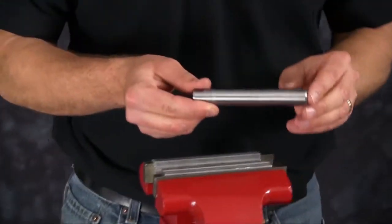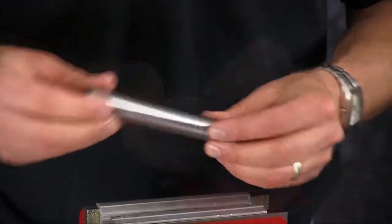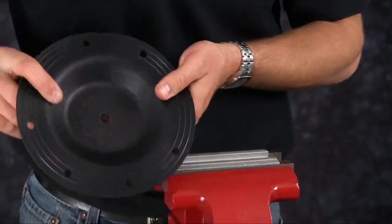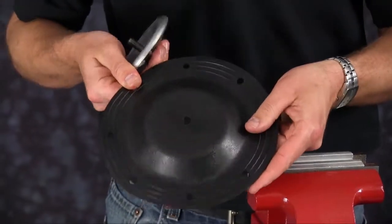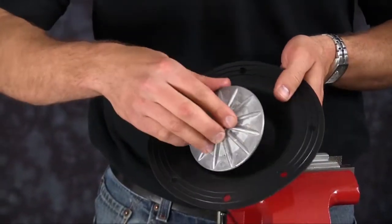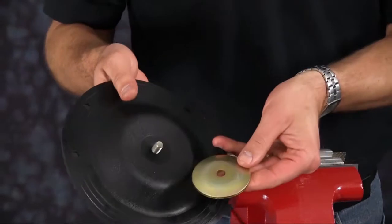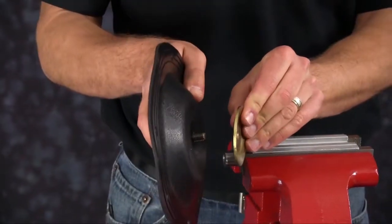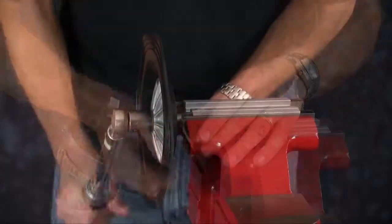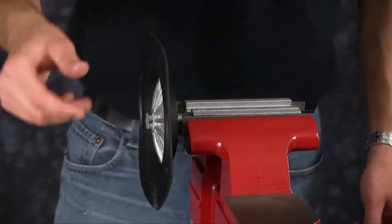Discard the old diaphragm. Inspect the diaphragm rod for any scars, nicks, or scratches and replace as needed. Inspect the inner and outer diaphragm plates — ensure the plates have no sharp edges or scarring on the radius. Note the orientation of our diaphragm; it does note fluid side. Install our outer plate in the correct orientation of the diaphragm. Inspect the inner diaphragm plate and note the orientation of the radius towards the diaphragm. Torque the diaphragm assembly to the rod according to factory specifications listed in the service manual.